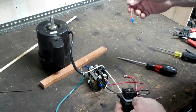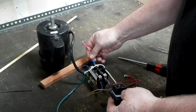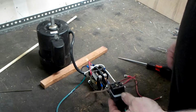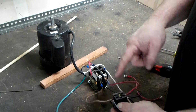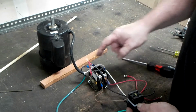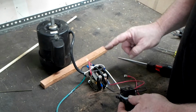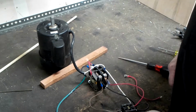So now we're on the back side of this, we're going to need to make our coil connection, which just so happens to come right back over here to the other side of the coil. Now, all of that is great. We have a loop. So now when this contactor pulls in, it will take power from the main and loop it through to the control side of this contactor, and it will have the propensity of keeping this contactor pulled in. It doesn't pull it in, it keeps it pulled in. That is the latch. This circuit right here, these 2 wires are the latch.